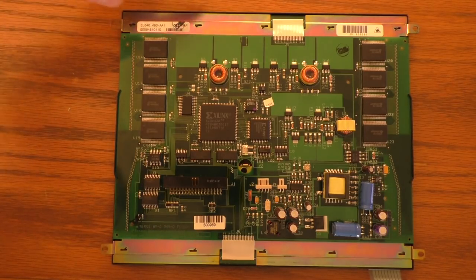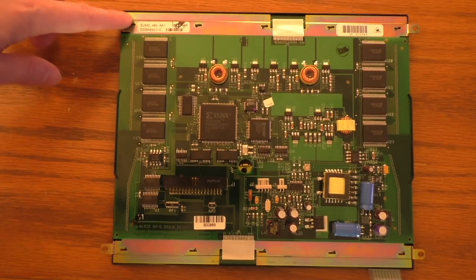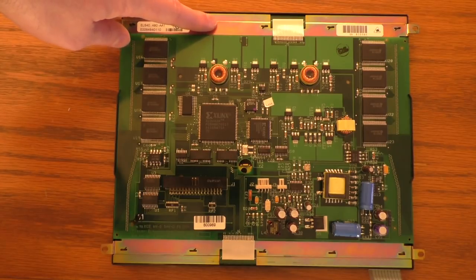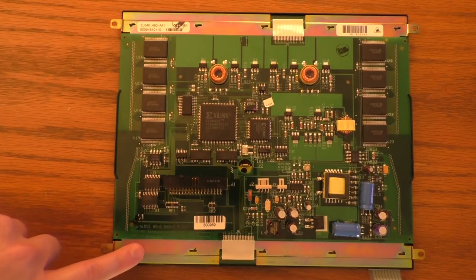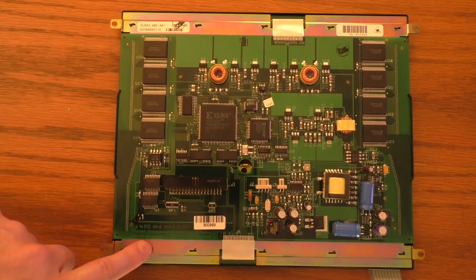And then along inside here with this cable, there are 1,280 column drivers, because it's 640 pixels, but it's red-green. And the display is in half, so the bottom half has another 1,280 drivers up inside here. I don't know if they're chip scale or what kind of packaging that is, but it's pretty damn dense. I think that's about it on the back.